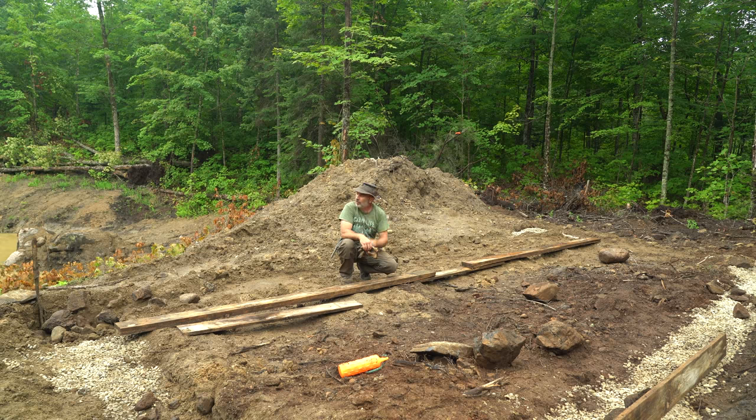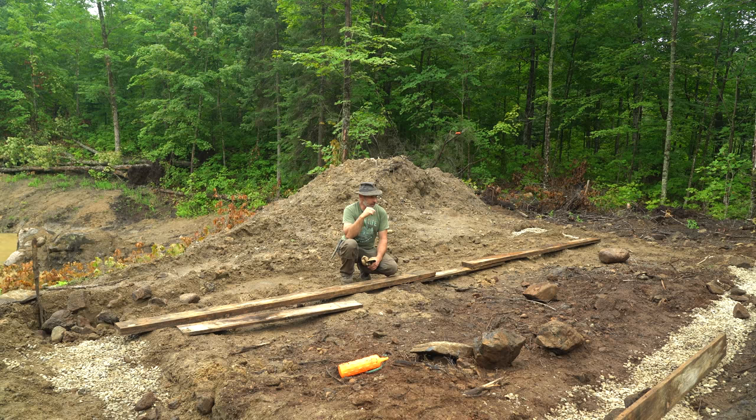The plan is to get this hopefully formed today, and if the rain stops long enough for a couple of days I can get it poured and let it set. Then I'm going to start on the wood — I've got enough wood milled now to do the full first floor, the basement and cellar. I have maybe two-thirds of the logs milled and hewed to start the cabin portion above. I'm going to do timber frame style, with about a seven-foot ceiling in the basement to keep modulated temperatures a bit better, rather than eight feet.